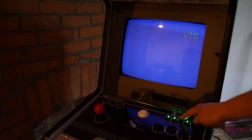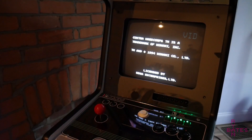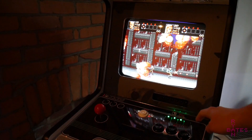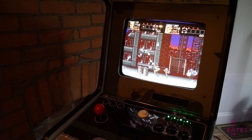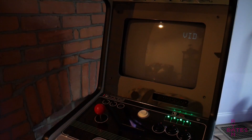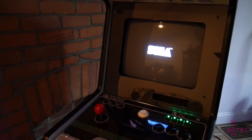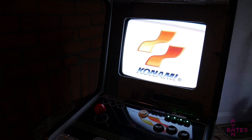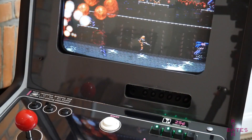The G key turns on the Sega Genesis, and the A key turns on audio — you can toggle the amplifier to quickly mute or put the game in a quiet demo state. Originally I wanted a button to turn the TV on and off through a relay, but this TV remembers its power state only while residual power remains. If power fully dissipates, the TV forgets it was on — so the button wouldn't work 100% of the time. Instead I made a large cutout in the bezel and just use the TV's front panel button.